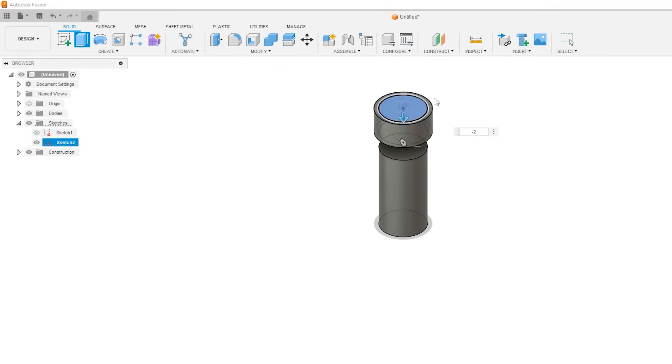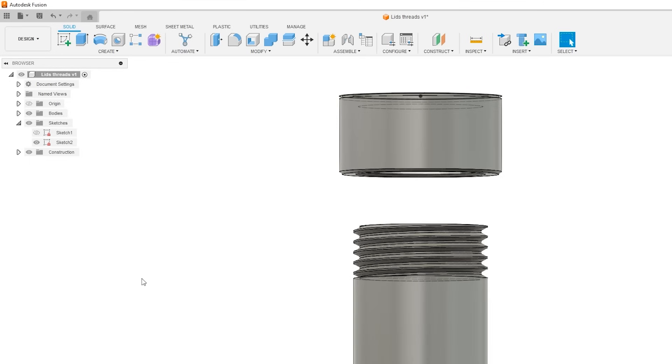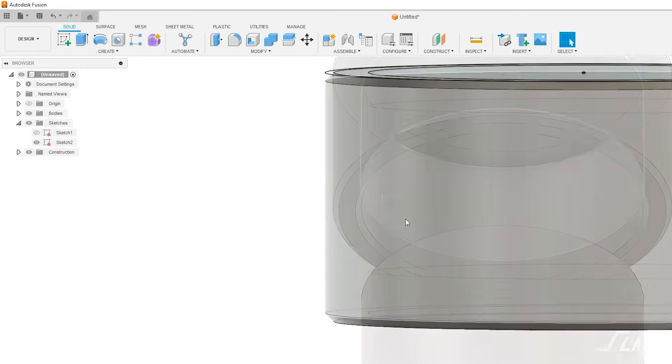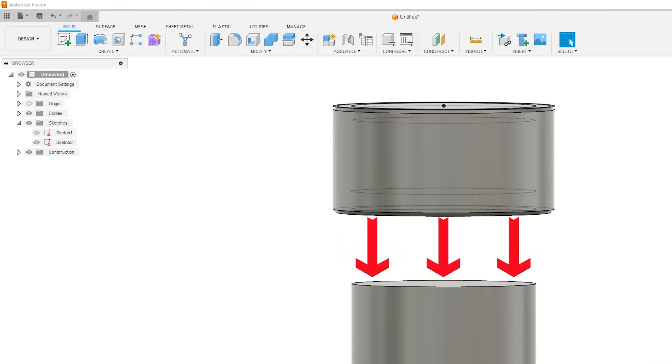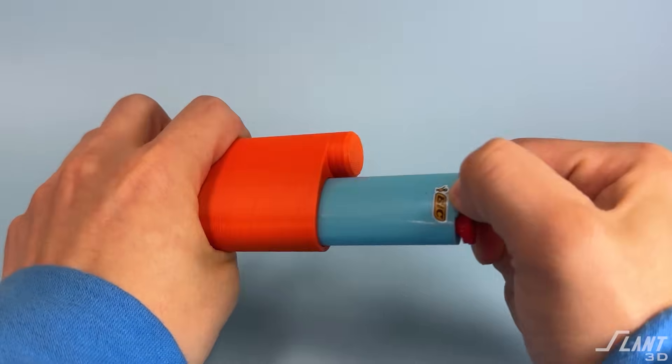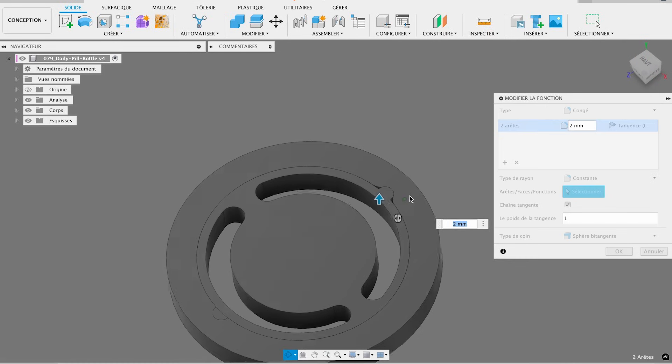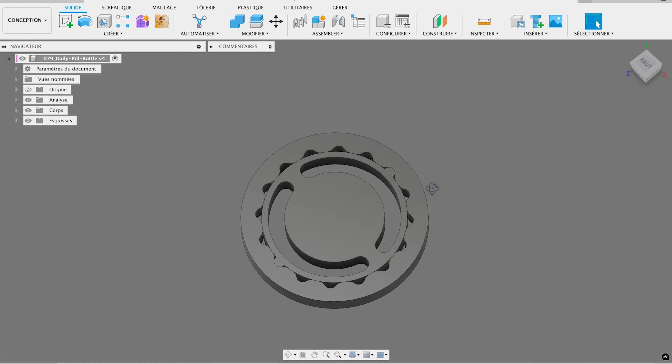If you want a lid, don't have it just drop in — you might add threads so it can tighten down, with threads sloppy enough to go on loose and easy but then tighten down firmly. Another thing you can do is design chamfered edges on all your parts so it starts inserting really easily and gets tighter the further you press it in — great for square lids where you want to insert a top plate that locks in. Just go really low tolerance from the start and then use mechanisms to make it more functional, because these complex mechanisms inside a part are now manufacturable in anything you want.